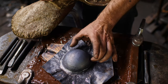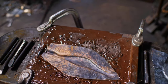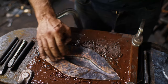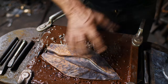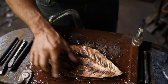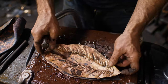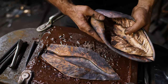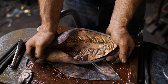While I'm waiting for my snout dome to cool off, let me show you the inner ear work. I made this inner piece, put some hammer texture into it, trying to figure out a stylized hair pattern. Once I've got this shaped, I put it into the pitch board and then spend time with some chisels moving pieces around and creating this effect. It will then go into the ear and tuck inside, creating a plausible shape. That's what's going on in the background - let's get back to this.